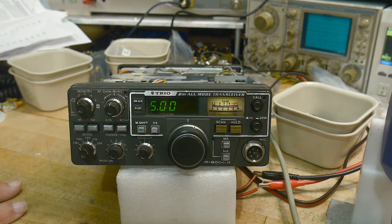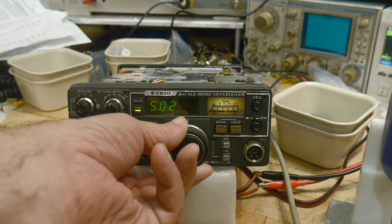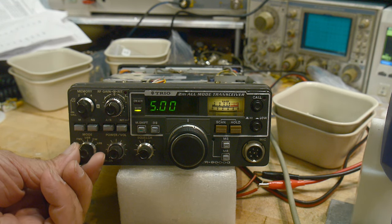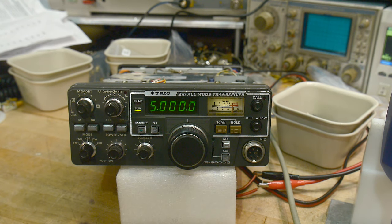So let's go ahead and I have my radio test set attached to it with my HP 8921A. Turn it on and I'll transmit at 145 FM. See if we get anything. All right. I think you can hear that. So works just fine. All right, so let's go to upper sideband. That sounds crummy because that's FM. Let's go over here to the analyzer and transmit AM. I can't transmit single sideband, but I can transmit double sideband with carrier, otherwise known as AM.